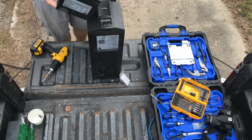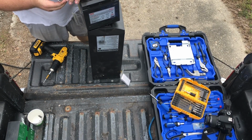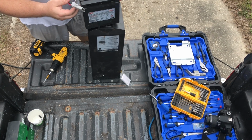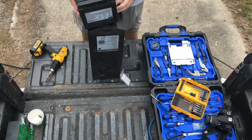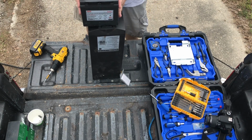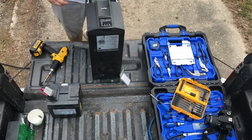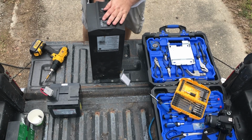Here we've got a bigger APC unit with two 15 amp hour batteries that are run together in series as well. Here it put four batteries into two 24-volt configurations. So two 12-volt batteries put together, as you can see here, in series to make a bigger 24-volt battery. And there's two sets of them in there.